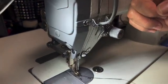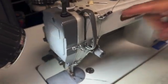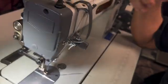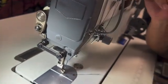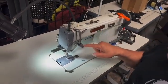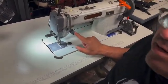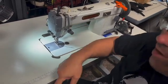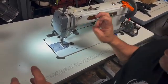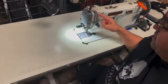Here's a take-up lever. The take-up lever on this machine works exactly the same as it does on the 18, on the 7 class, on the Class 26. They all do exactly the same thing. So then again, the guides guide the thread to their necessary components. You need thread tension, so you have to guide the thread through the tension device. You have to pull the knot or seat the knot, take up the slack out of the knot, so the take-up lever is in play.